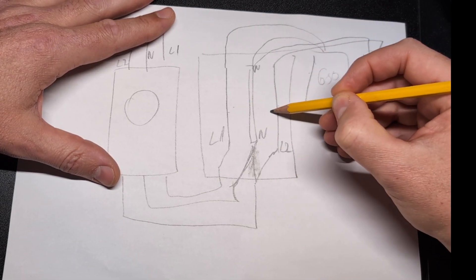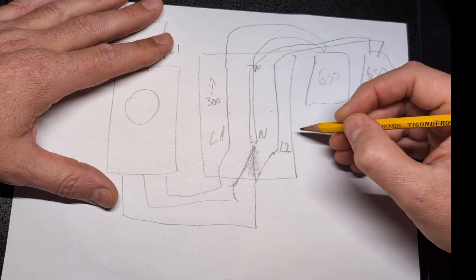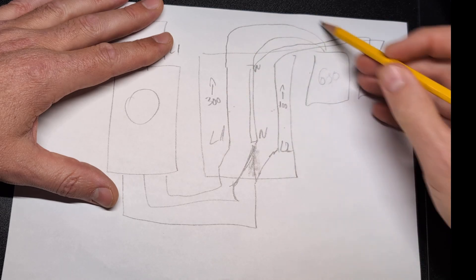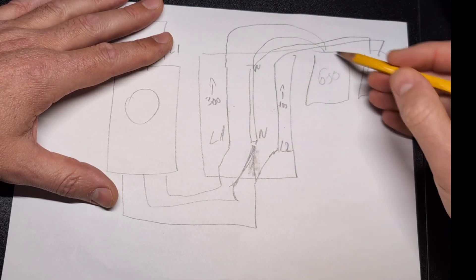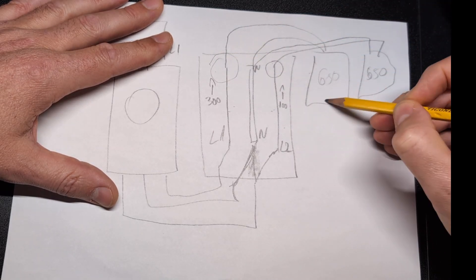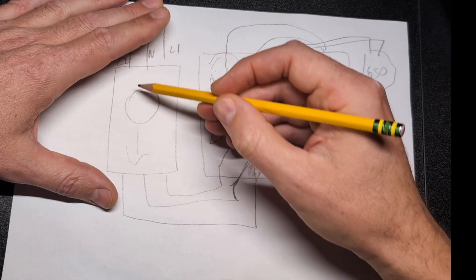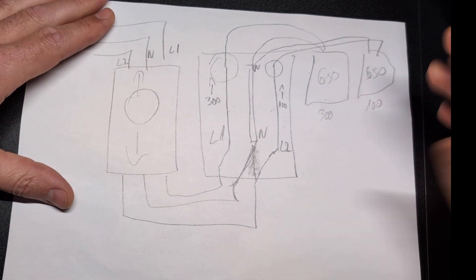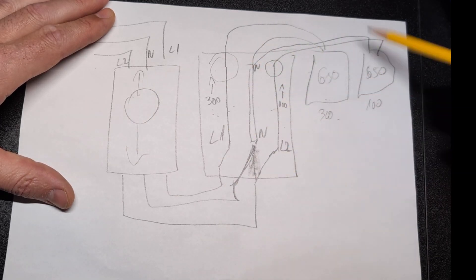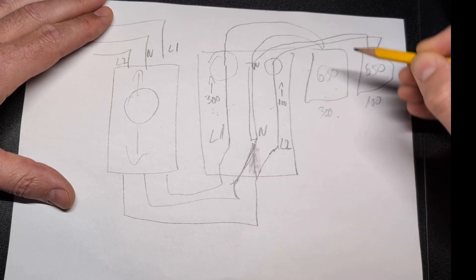The lines inside the house are never completely balanced. Say you have 300 watts being pulled from L1 and 100 watts from L2. You could separate the inverters — put one CT clamp to read only L1 and another to read only L2 — so one produces 300 watts and the other 100 watts, satisfying all power going in and out of the meter. That was my initial idea, since I always have more consumption on line one than line two.